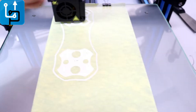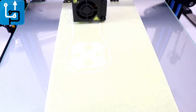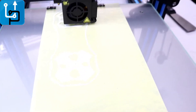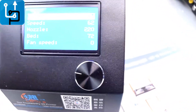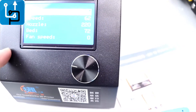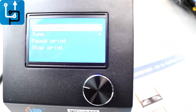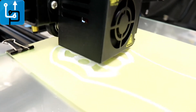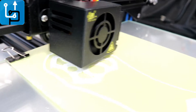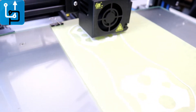Right now I pretty much cheated — I moved it all the way to the left and it started printing from there. I used the CRX settings, the original ones that were in there, not the S version because the S version settings are a little off. On the heating bed I had to adjust a couple of things. I had to put speed at 62 because I had to slow it down since it was messing up. The nozzle is at 220, bed at 74 because it still goes down to 60 or 50. Fan I didn't mess with. I just tuned it out a little bit. I've got to set that up properly in Cura before printing because right now it's not lining up. It's melting some of the top, it's hitting. I tried to balance it — it's balanced right now — but there's something else I still have to tinker with.